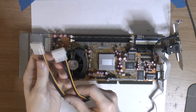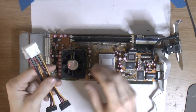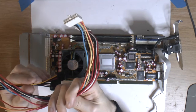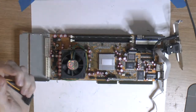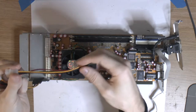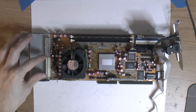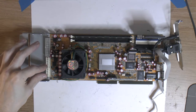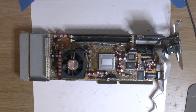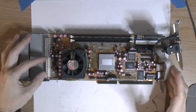What I wanted to do was take a couple of Molex connectors from the power supply on the system this is going into and splice them onto here. But the problem is we've got 12V and 5V on our Molex connectors, and the AT standard calls for plus 12, plus 5, minus 12, and minus 5 optional. So we have three voltages and we're missing the negative 12. I have tried this motherboard with only 12 volts and 5 volts and it works.